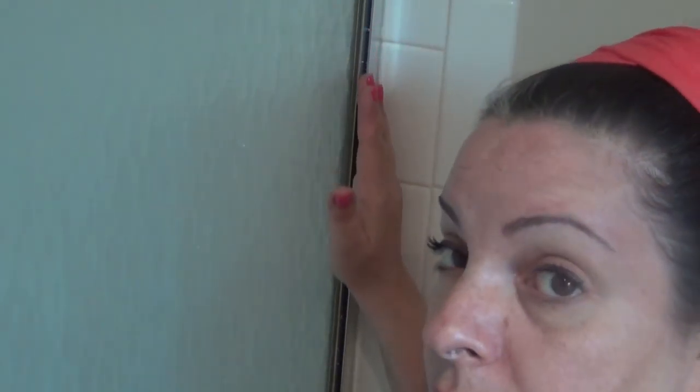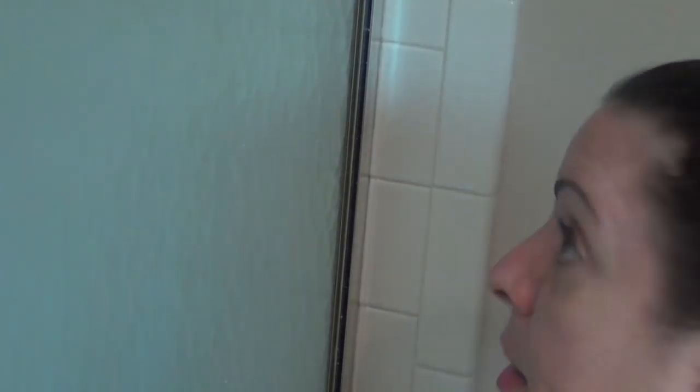I want to make sure I have a really clean angle here in the corner. If I leave any silicone when putting my new caulk, it's going to give me bumps — and those bumps will literally trap dirt and mildew in those little cracks, which is how caulking starts to look dirty. So I want a really clean line. I'm not changing these tiles — they may get painted — but I still want a nice finished job, unlike the previous work done here which was really bad and nasty.